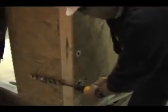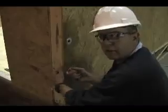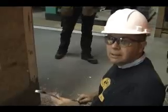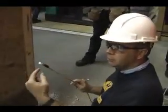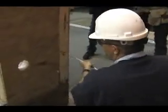So I'm all the way over to that point. Now we're going to pull that wire all the way down through this chase. It'll come out, reach in here, turn it around, and push it back out here to give access into this wall. When we push the wire, so we don't get a sharp edge, we'll roll it over, tape it up, and then we have the ability to just push it straight through.